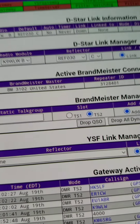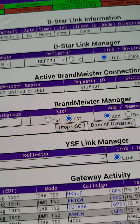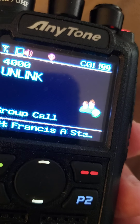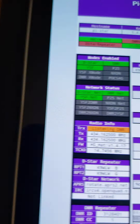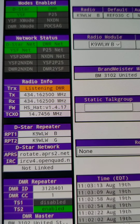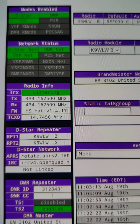I have three digital radios here: the AnyTone for DMR, a Yaesu for Fusion, and an Icom for D-Star — all programmed to the same frequency. Starting with DMR: since it's scanning, you need to hold push-to-talk for roughly two seconds to wake the hotspot up. I key up Brandmeister talk group 91. After releasing, the hotspot shows 'transmitting DMR' in time slot two, and on the admin page I can see the active Brandmeister dynamic talk group 91.